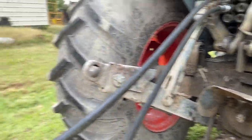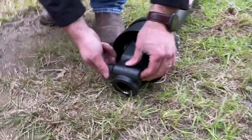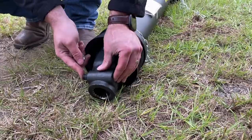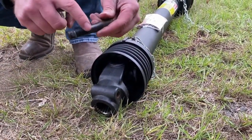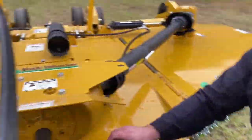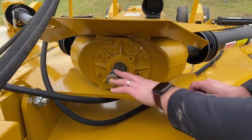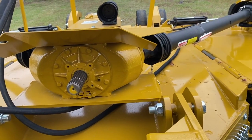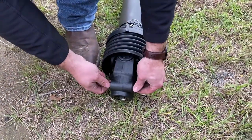On the other side of the driveshaft, that goes to the gearbox side. It's the same concept, however it's a tapered pin — that's a three-quarter nut. As you can see, it's got a tapered middle part to it. That taper needs to sit right in the groove of the divider gearbox. It'll only go in one way. If it doesn't slide right in, then it's not inserted correctly. Once you do that, you push it back through.